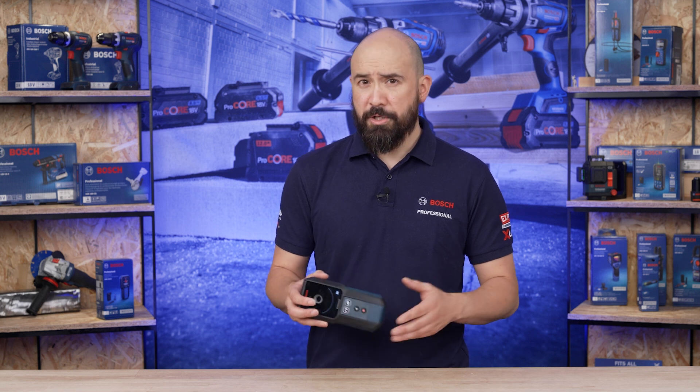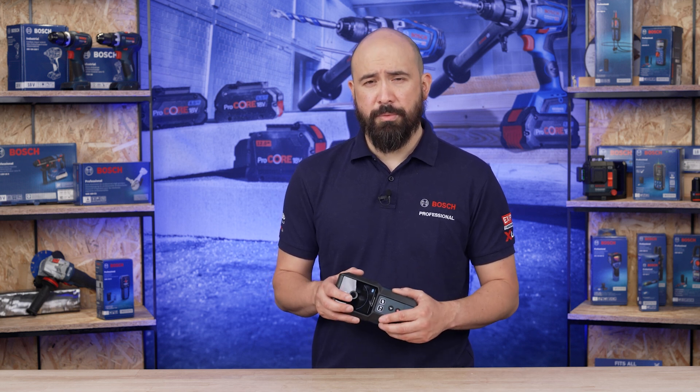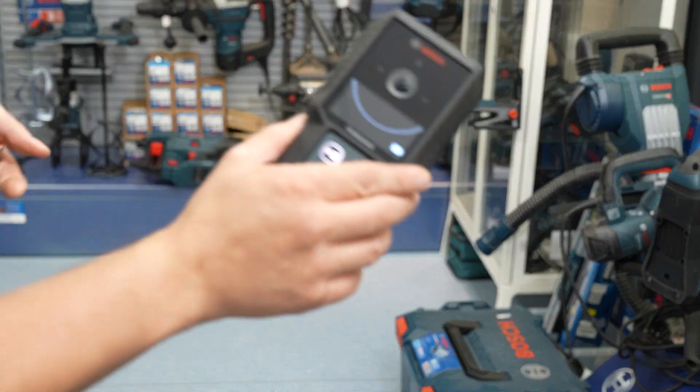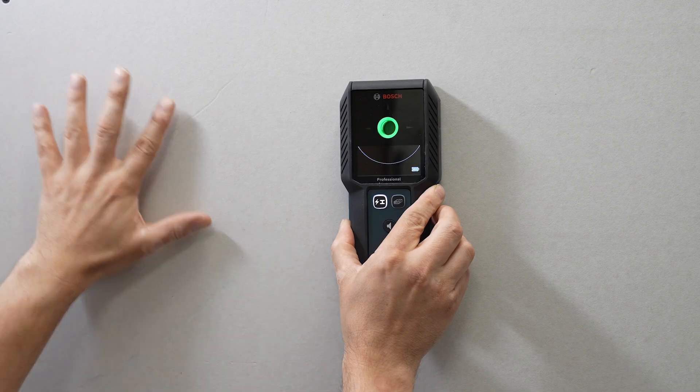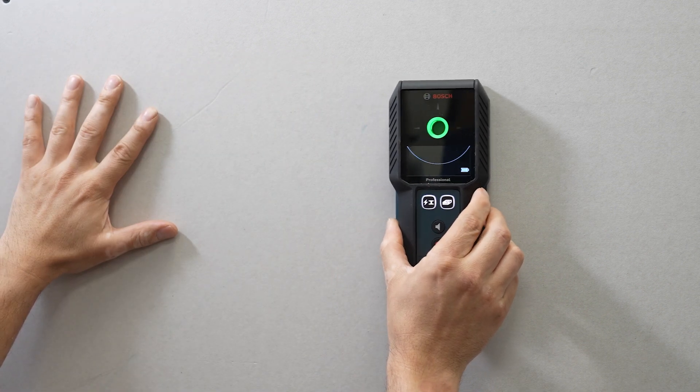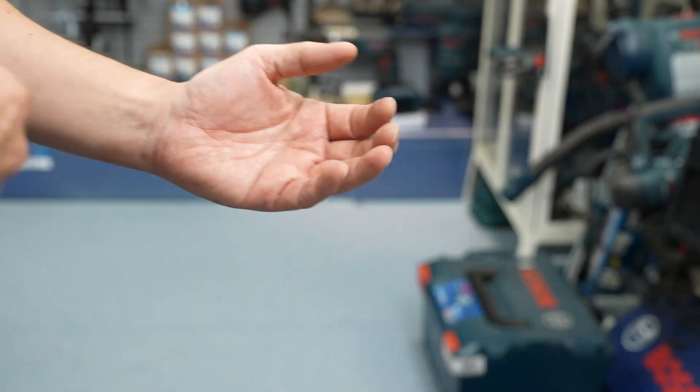The following is especially important when attempting accurate live wire detection. Remove rings and other metal jewellery such as watches to reduce potential interference. Beware of potential electromagnetic interference such as active Wi-Fi routers and mobile phones. Static electricity can cause wires to be detected inaccurately — you may find a false reading across a wide area, or it may prevent them from being detected at all. To improve detection, place your free hand on the wall near but not too close to the measuring tool in order to remove any static electricity. If you're wearing insulating gloves, remove them.